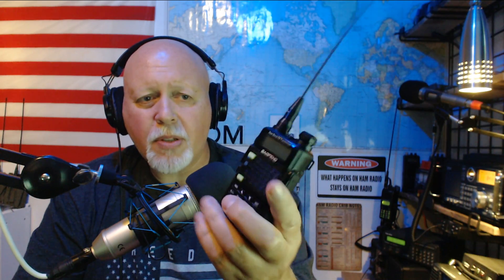I seriously was resisting doing reviews on Baofeng radios because of that performance. But at least for my experience, the ones I went in and adjusted the squelch settings on made a real difference. You might have to mess with it — not every situation is the same. Set it on scan and go through all your repeaters or frequencies, use it how you would use it, and if you need a little more or less, give yourself a good spread on your numbers.